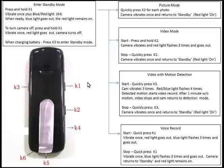I'm using a 16 gigabyte micro SD card. Now I'm using a class 10, so I haven't tried it with any other SD cards. But it will record, I think, somewhere in the vicinity of maybe 13 or 14 files, almost a gigabyte each in size. And once it fills up that SD card, it will start rewriting. It will cycle through and start rewriting over the first recording.